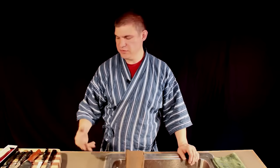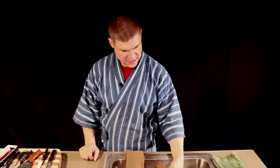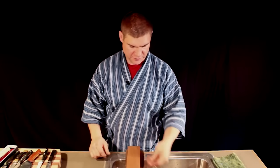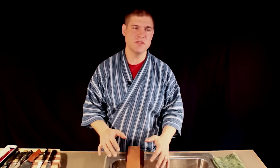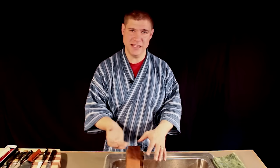Okay, let's actually get to grinding that new primary edge in according to step 5. Let me get my stone out of water. I love the water stones because you can use as much water as you want. Diamond stones, while they're certainly harder than steel and they'll grind metal away, sometimes they're too hard. They leave too deep scratches in your steel. And the diamonds, they fracture over time and they become rounded out. And usually those diamonds are only ever 1 layer deep.